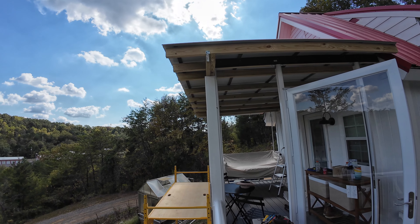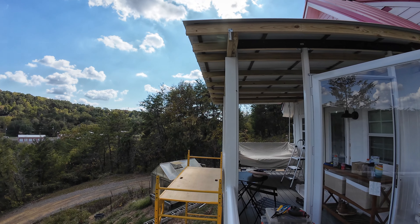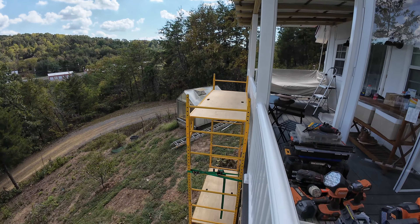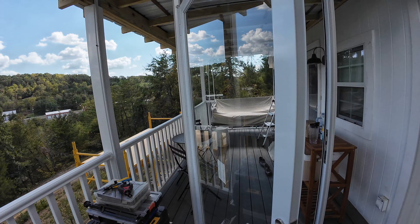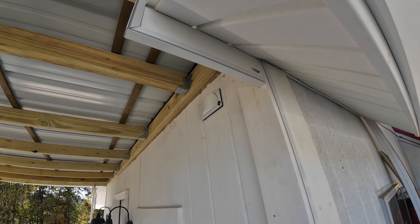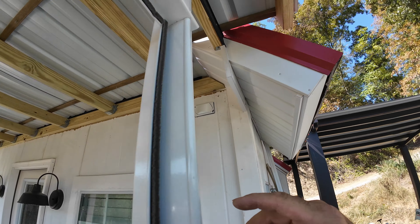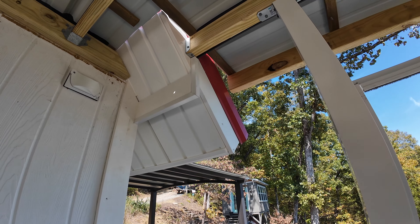I may go grab my safety fence just so I have something on the back side - I know that will make TC happy. Then I can go ahead and put my screen track along the top, silicone a couple of edges up there to get them good and sealed for bugs. I'll also be able to work on a gutter from there too - I may need to get a section of gutter prior to moving the scaffold, because I'm going to have to do this seven-foot section and then move it over to do the other seven-foot section. For the trim solution, I took a piece of trim, 45-degree pocket hole screwed it into that side, and this side's just got the mini track holding it into place - then I'll caulk that seam with white silicone.